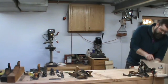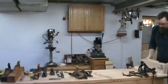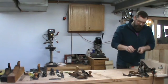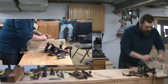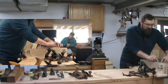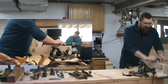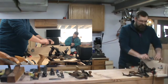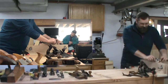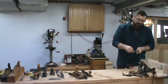The nice thing about a spoke shave is it's great for curves. If you're going to put a curve on a piece of wood, a block plane or a bench plane is kind of cumbersome, whereas the spoke shave will allow you to make a much simpler cut. When you're using this, same thing as with the plane — sometimes you'll see me twist. You get a feel for doing this because sometimes you start on one side and you move the plane to the side as you cut. I'm taking too big a cut there so I'm going to back it off a little bit with these screws.